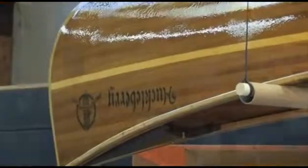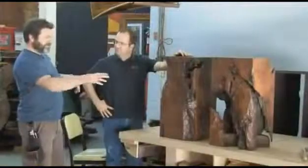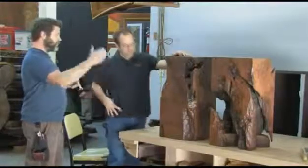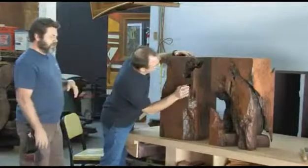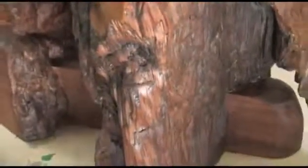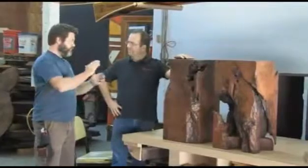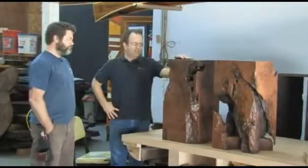These are side tables for you, right? Yeah, I think these would make a couple nice nightstands. Yeah, they're beautiful. These were one big piece of a stump when I got them, and there was this weird void with some rot, so I cut it into two pieces and ended up having to install a foot in that second one. But I eventually get them close enough where I can put them under that jig and flatten all six sides. I think if it's the same jig, we should cover them in the article.